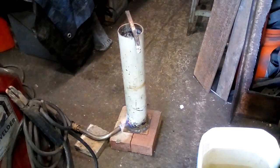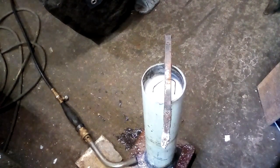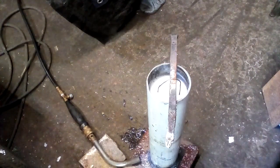We've got the phosphating solution in a steel pipe with a base welded on it. The work pieces are hanging from an iron wire, suspended so they don't touch any part of the pipe. A little torch is keeping it up to a very slow boil — you don't want it to boil over, just simmering along, happily boiling — sort of just boiling enough to have a light froth on the top. You have to do this for two to four hours. If you have to add a little water to keep the fluid level up, that's okay too.